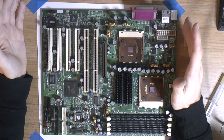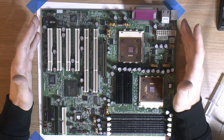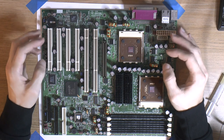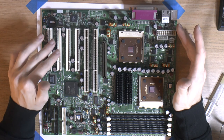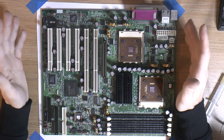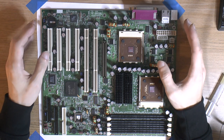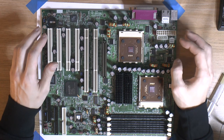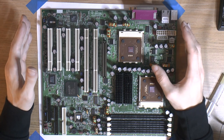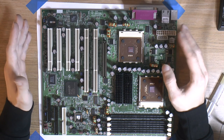So yeah, and I want to recap this board. I have a couple of Tyan boards, dual socket 940, so basically what came out like a year after this. And all of those died. Bad, the caps started swelling, leaking. They died within like 3.5 years at most. I did replace some caps on those back in the day when they were new, but none of them had caps that lasted very long past 3 years.